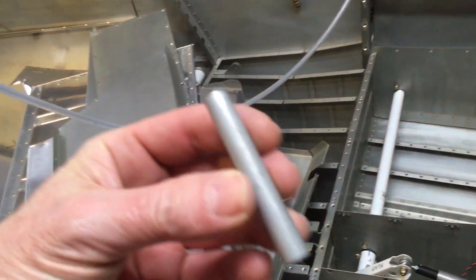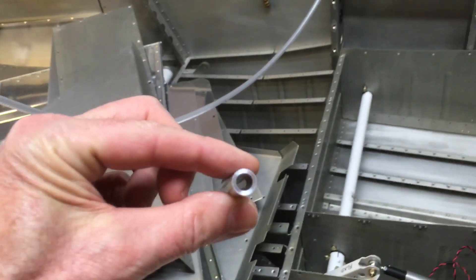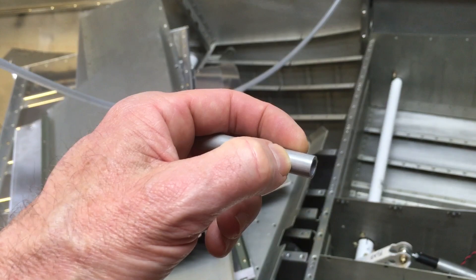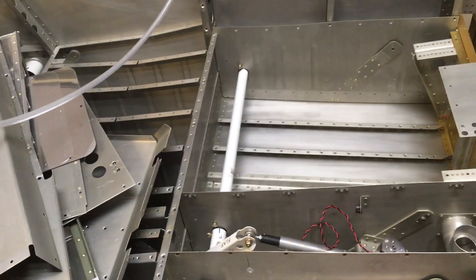Here's part of the tubing — this would be for an AN4 bolt, quarter inch. I just stuck that in the lathe and that way I can measure it with a parting blade and part it off to get the length right, and then I can face it down if it's too long. But that's it for today. See you next time.